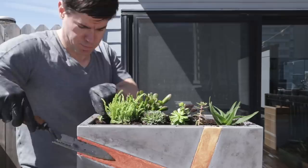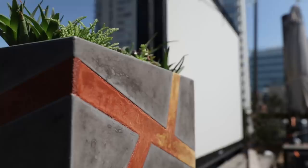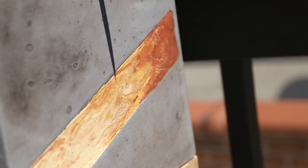I want to talk quickly about some things I learned or could have done differently. I'm really happy how this came out overall, but because I was trying to make it simpler, I poured all the concrete. There was some cracking in the stripes and the edges between the gray and colored concrete aren't quite even because of how we poured it in. If you wanted a perfectly smooth surface, you could mask off the lines, spray or brush in a layer of the colored concrete to make the stripes, pull away the masking tape, and then spray the gray back coat over it — you would get a perfectly flush stripe and a cleaner result. You'll also want to check out the videos from Rag & Bone Brown and Chris Salamone that they did as part of this Hikoki limited tool challenge.